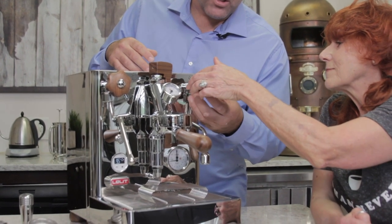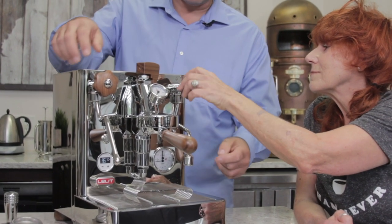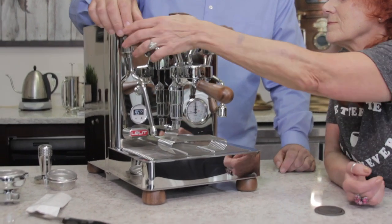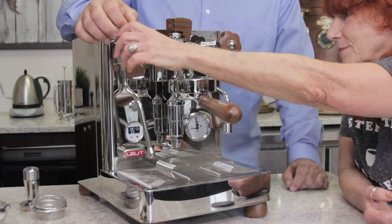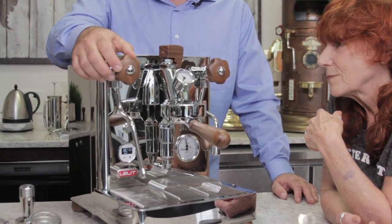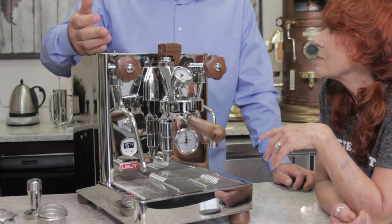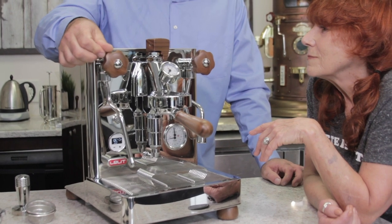What non-compression means is you don't want to tighten until the knob stops. Feel how loose it is here. You're turning it until the steam or hot water stops — not until it's tight. Open it and feel the tension, then turn until you have no tension in the rotation of the knobs. This makes the knobs and gaskets last longer; if you tighten to where the knob stops, your gaskets will wear faster.